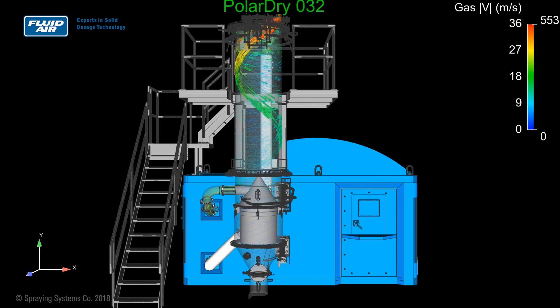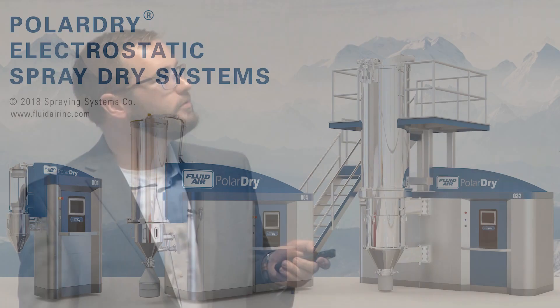It's a co-current system, so we introduce heated air into the atomized spray. It dries rapidly, and the rest of the system is generally designed to separate the product from the exhaust airflow. On a production system, it usually feeds a vacuum takeaway, and on our larger systems, we dehumidify the exhaust air and reheat and re-inject.